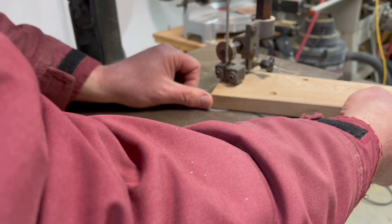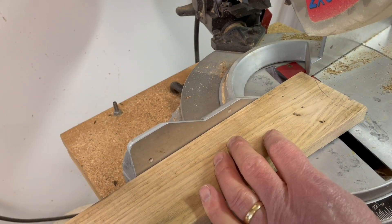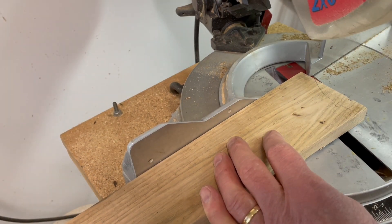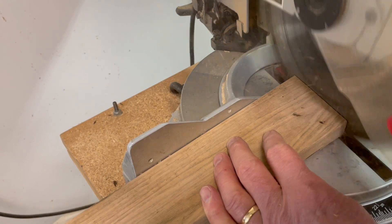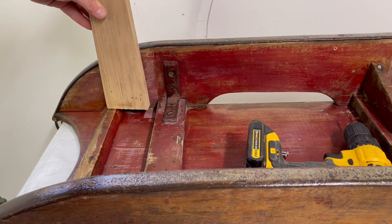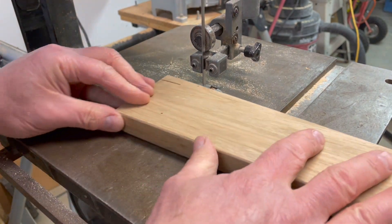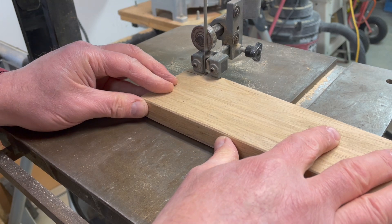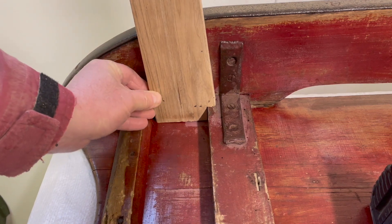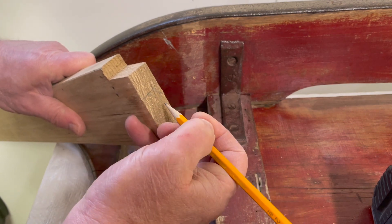You'll see a little later on that this wasn't actually sufficient to hide the legs through those spaces, and it just goes to show that dry fitting them is often worth it. The two back legs are splayed backward, so at this point I'm cutting the angle that I want. I thought they could be three and a half inches wide and fit between those two slats, but they actually need to be three inches, so instead of cutting them narrower I just cut a notch out of them. Then I mark each leg: front right, front left, rear right, rear left.